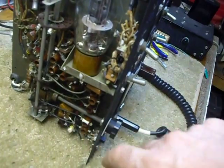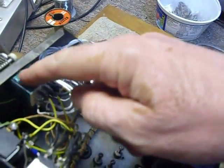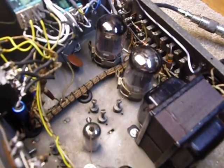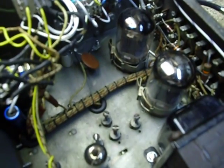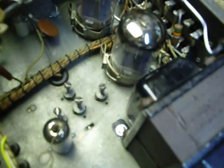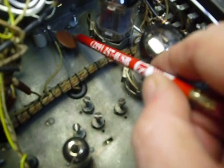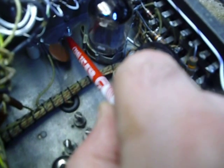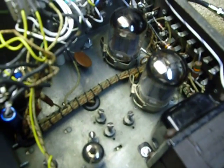I was really getting frustrated. One thing I did that I think was a good change — you may notice I've got relays in here, so I use push-to-talk. That's in the Harvey Wells manual, by the way. I also put a bypass capacitor in there for the plate supply right where it goes onto the output choke. That's a 0.05 at 600 volts. There was already a screw there, so I added a second 6-32 nut and a little ground lug soldered onto it and put that right on the base of the choke coil. There was no bypass there and I thought there should be one, so I did that.